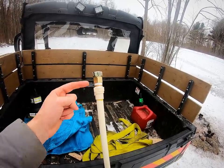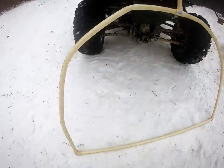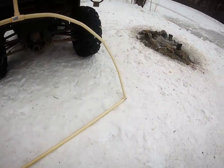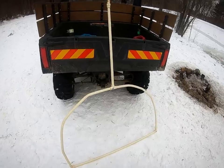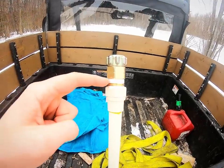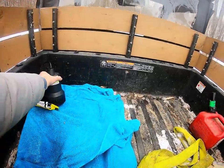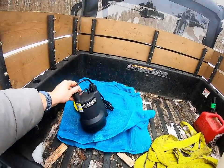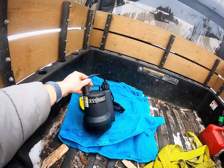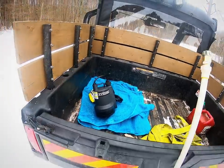So you'll need three different connections to get you to a garden hose. After that, you're going to need a T and then two 90-degree elbows. You're going to need some plumber's glue to put these all together and make the connections watertight, and some plumber's tape for the threaded connections. Then I went out and bought a portable submersible utility pump — this EverBuilt is one-sixth horsepower and rated for 28 gallons per minute. Should be plenty to do this pond in a hurry.